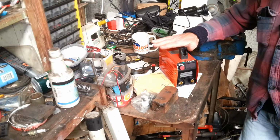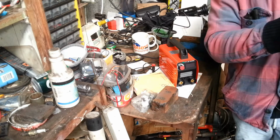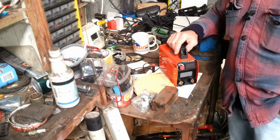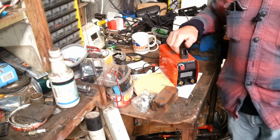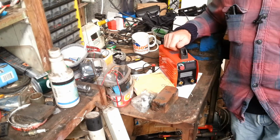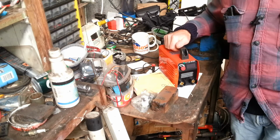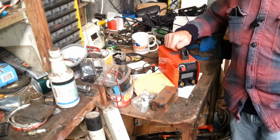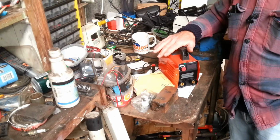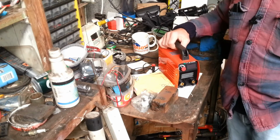The reason I bought it really was I have a job I have to do down in the hangar, which is about 200 odd meters from here. It doesn't have a power supply down there, so all I have to use is extension leads. And using one of the bigger, heavier welders there, on that length of extension lead, you'd probably have smoke. You'd probably have damage to the machine as well, not enough energy. So I decided to try this. And I have another job on the shed next to me here that has to be done high up on the roofs. That would be ideal.